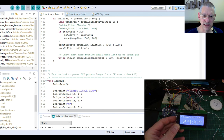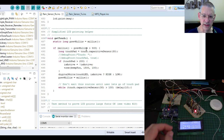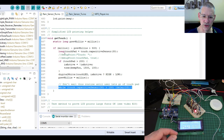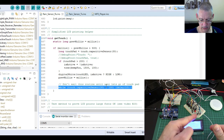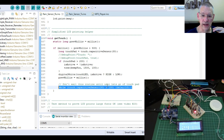The touch routine runs every half second so the user has a chance to take their finger off the button. It's been slightly enhanced: once a touch is acknowledged and a beep is played, nothing else happens while the touch is still detected — it stays in a waiting loop until the finger is removed. Only then can it be triggered again. So touch it once — beep, light off — nothing else happens until you release.